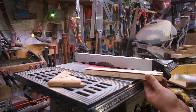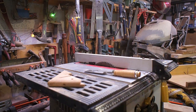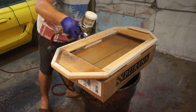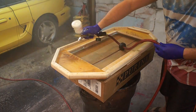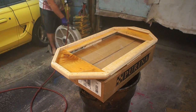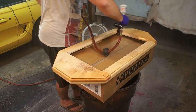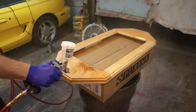After I get that cut out, all I have to do is remove this little piece of wood on the edge. I cut this into three different pieces so I can do two on the top and one on the bottom, just because it's broken in kind of a triangular shape on the top. I got a mini HVLP spray gun from Harbor Freight and it's been working really well for wood projects where I don't need the full gun. This is an automotive 2K clear — a two-part catalyzed clear coat. I wanted to give it a really shiny finish and really bring out the grain, the chatoyance of the wood, and it's a really hard durable finish — think car finish.